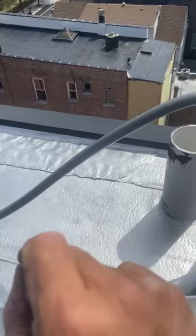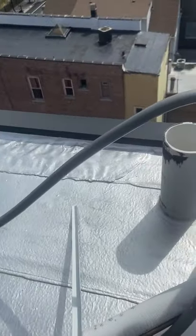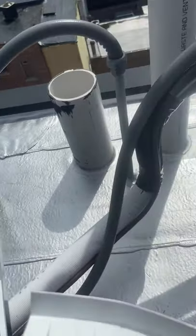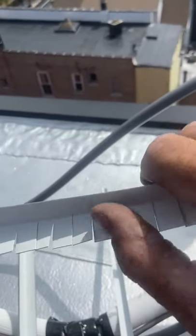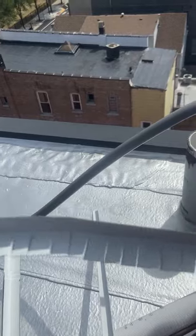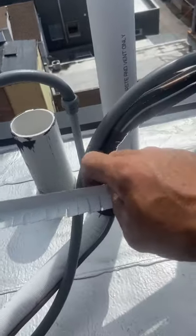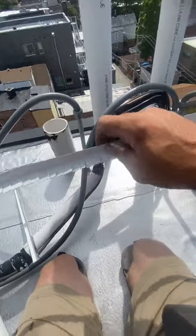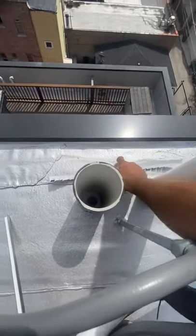On the metal brake I bent myself pieces of aluminum — could be any metal but we use aluminum. I bent three-quarter by three-quarter because in this particular case I want to have a three-quarter height of sealant. Then I cut with the snips, lots of cuts every three-quarter of an inch, every half inch, because it's easy to work with when there are lots of cuts. Then I go around the pipes.